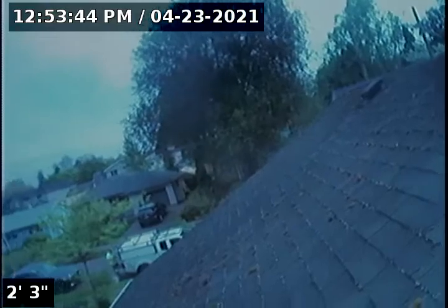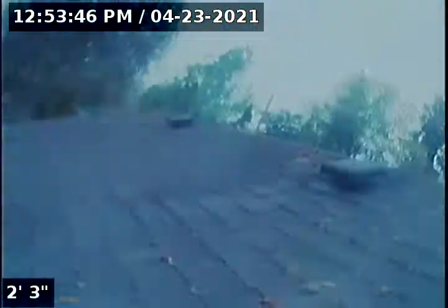On April 23rd, 2021. The house is facing east — there's the east street beyond that ridge. I'm on the roof here facing east, where I've located a four-inch cast-iron plumbing vent. I was unable to locate a proper clean out in the basement or around the exterior, so I'm going to attempt to go through this vent. There's a ledge here making it probably a little more difficult.